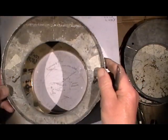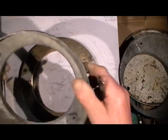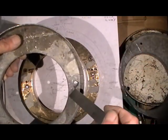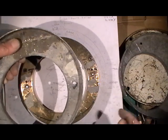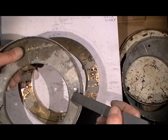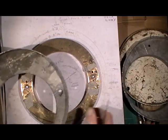So then I come to the inner flange of the throat plate, which is a different offset. It's not only a different offset, it's inverted and turned round at the same time so that they clamp together. So my stay holes on this - because it's going to be inverted with the offset at the top - my stay holes have got to be half inch below the center for it to match up. So I mark me stay holes off half inch below center, six and a half centers.